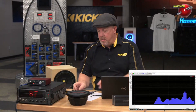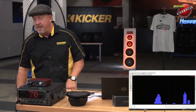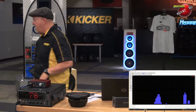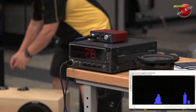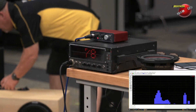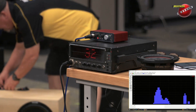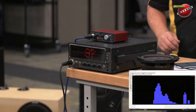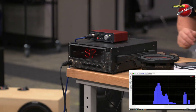Let's do the sine wave — and that would be clipping, in case you want to hear what clipping sounds like at 39 hertz. Woofers out of phase: 78 dB output with the sine wave. And with them in phase: 97 dB.